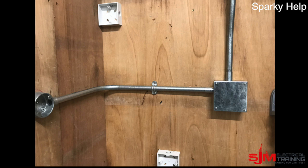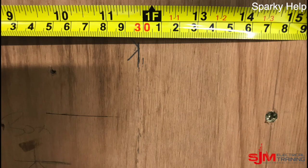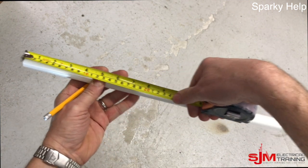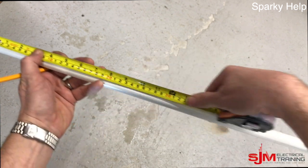We've got two boxes and we've got to set over a piece of conduit. The first thing we're going to do is measure roughly to where the back of bend is, projecting a line up so we know roughly where it is. It is an approximation — we're not going to try to bend to measurement. It's approximately 300mm to the back of bend. Don't try to be precise with plastic, so we're just going to mark 300mm.